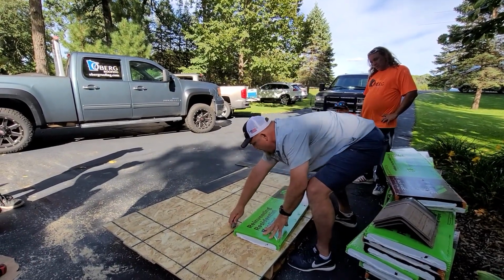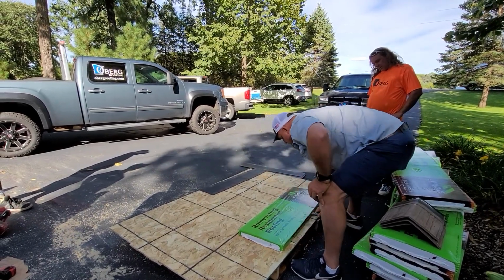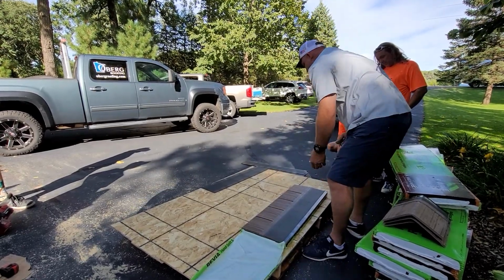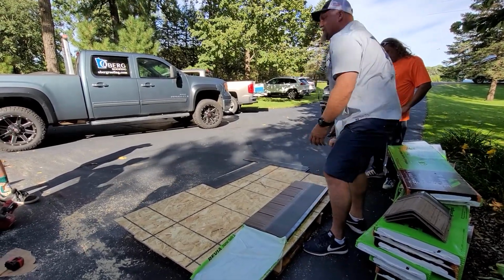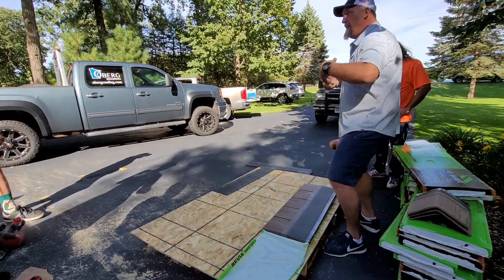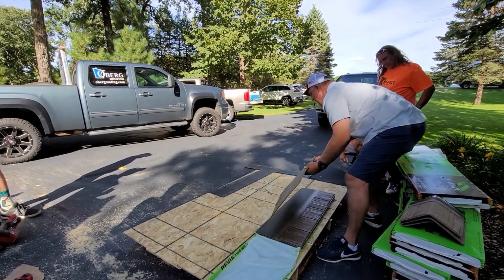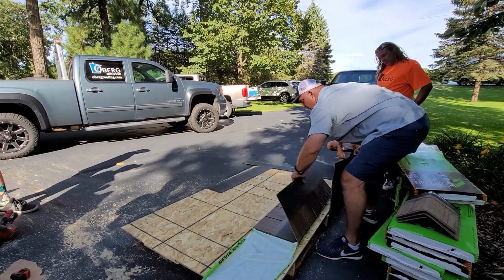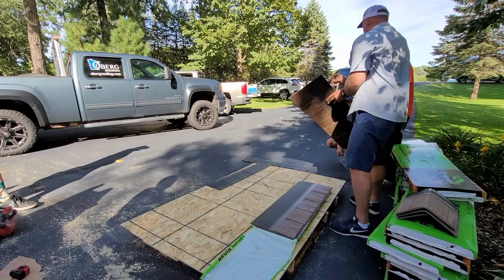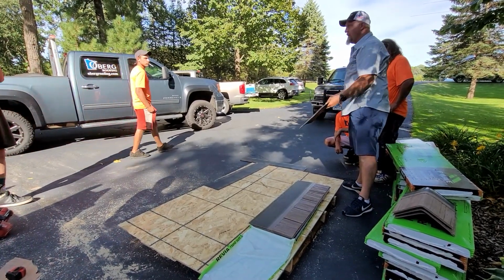What you want to do is cut it at least 3 ways like this. You bring the shingle out like that, okay? The reason why is because you guys are different types of crews. Some crews always got some guy feeding them. The guy that's feeding them, what I want you to do is pull the shingle like this. You can't pull it this way, and then the other one comes this way. See how that just snaps? If you try to pull it through, and you feel the sealant on the backside, it'll stick. It'll never get it through.